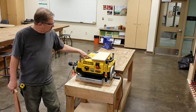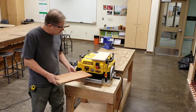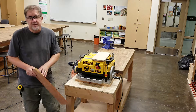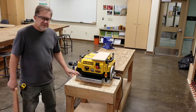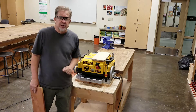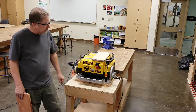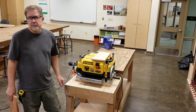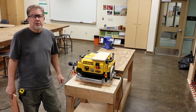Step number four: use the machine correctly. With a planer it is possible to have a kickback — the machine spits the board or a piece of it back out the other side, especially if there's a knot or crack in it. Stand off to one side. If something gets clogged inside, do not remove it with your hand. Unplug the machine, raise the carriage all the way up, and call me over. Do not reach your hand into that machine for any reason — I don't care how unplugged it is.